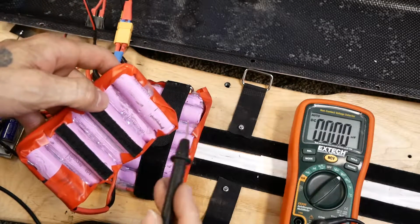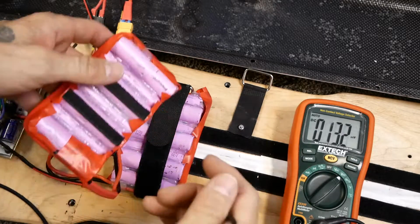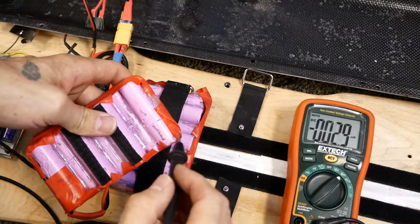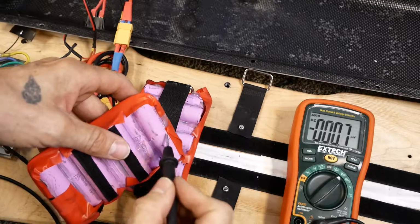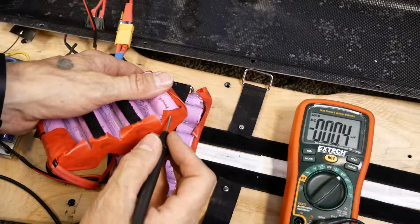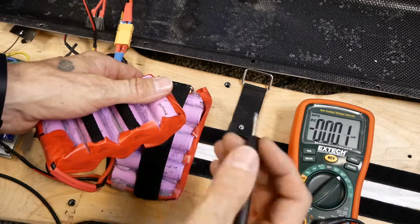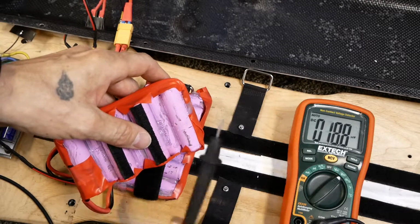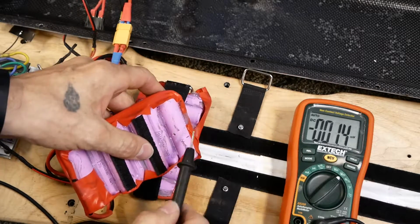Now, you might be thinking, the case is grounded. If you've ever checked this, if we've had enough problems with these batteries, ripped them apart, wore the shells off of them, you can find really quick that the flat tab on the bottom, the negative, does actually wrap all the way around the battery, right up to the tippy top, about 2-3 millimeters away from the hot. So if this melts through here, then you're going to have a problem. Had some of that with the battery welder.